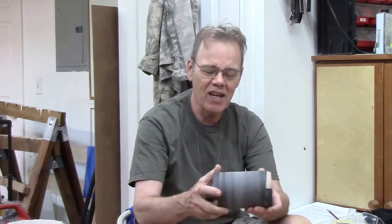A second tip from Ed, which I also thought was excellent: on the spatula video where I made the round drum sander on my lathe, I staple the sandpaper on, which makes it tough to sand near the staples. He suggested using double stick tape instead — it's like, duh, I should have thought of that. Great suggestion, Ed, and I appreciate you submitting that.